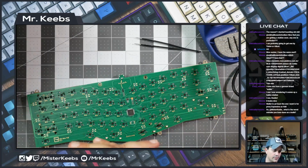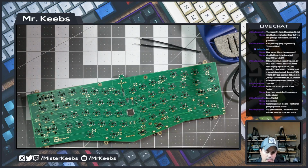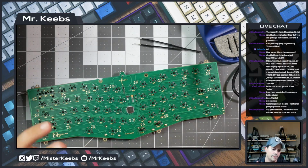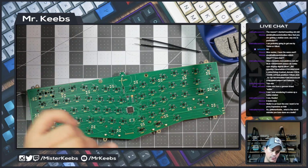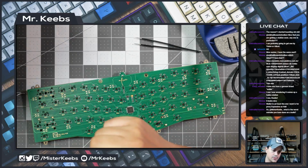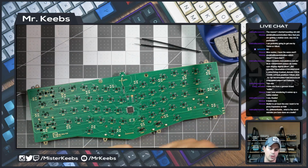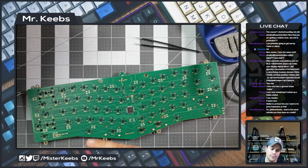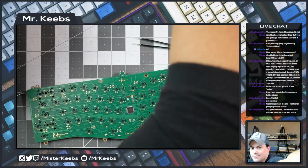What is the worst mistake you have ever done on a build? Actually, I almost did that mistake yesterday. I did start soldering this board, but I only did like 3 switches without putting the stabs on. But I had everything that you can imagine. I had stabs with the inserts done the wrong way, so the stab wouldn't work. I think last week I soldered a Pro Micro without soldering the switch, so I had to desolder the Pro Micro. I am like an expert in making mistakes, so I think I made most of the mistakes you would expect.